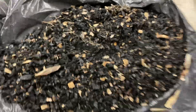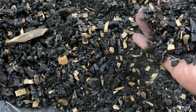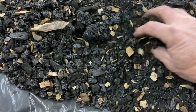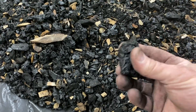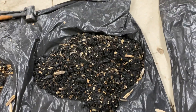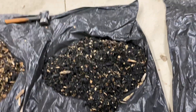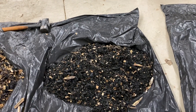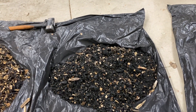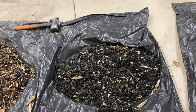As I examine it, I can see it's mostly pyrolyzed wood stuck together with tar that never made it down to get burned up. It's obviously pyrolysis going on, which is good, but it's not finding its way down into the combustion chamber quickly enough to get burned up. That's an issue I have to understand better — it's as though material is not moving through the system fast enough.